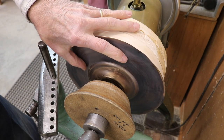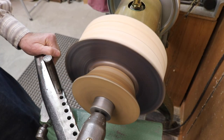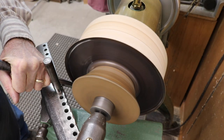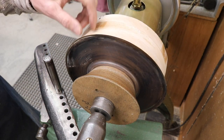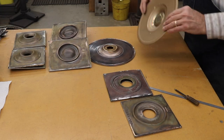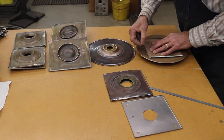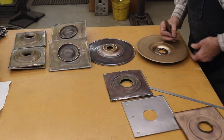And the final spin on the second piece. I'll use the old pieces to size these to the correct dimension and also leave a 1/8 inch extra on each side so that I can turn them into a 1/8 inch deep pan.